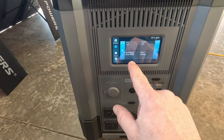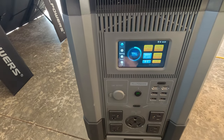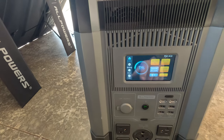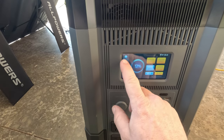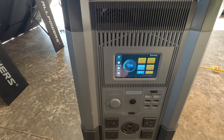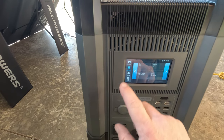In Mute mode — the slowest charging mode — we're at 522 watts off the grid and 270 watts off the sun. Switching to Standard mode, it jumps from 517 to around 1021 watts. Going into Fast mode, it jumps higher — now we're charging at 1540 watts off the utility and 270 watts from the solar panels. I'm not in a huge hurry so we'll run in Standard mode.